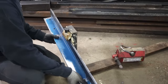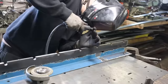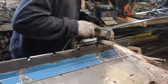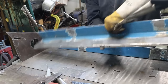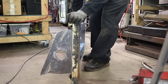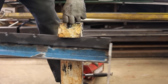Before moving too fast, I did a test to see how the lock fits with the notches. Perfect! Knowing that everything fits, I made a gouge between the angle iron and the flat bar to fully weld the two together. I cleaned the weld a bit since this is the face that the forks will ride on, and I wanted it to be baby-butt smooth-ish. With the two angle irons done, it was time to put everything together and check the fit. I've built smoother sliding mechanisms than this one, but I think it's gonna be just fine.